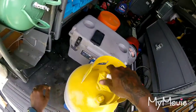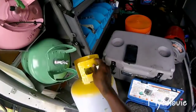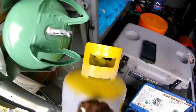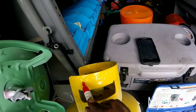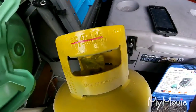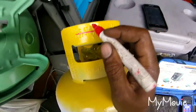This thing empty — this size cylinder weighs 28 pounds. Nothing in it. And if you look right here on all these recovery tanks, when you see that WC marking, that's basically the 80% right there — it's going to tell you how much refrigerant can be in here. 47.7. It's usually indented and engraved on all of them. 47.7 — that's how much you can put in here. I like to use a rule of thumb: if I get 40 pounds in here, I'm good.